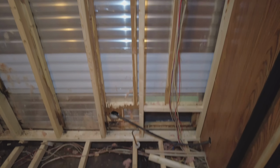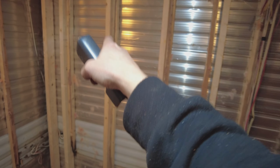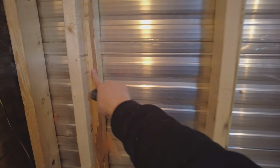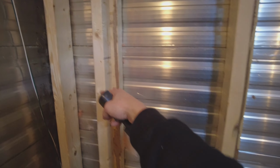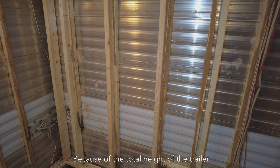I'll just flip this around so you're not looking at my head and you can look at what I've done. Yeah, so right in there, that's where the furnace goes. This area here, if I wanted to later on, I could remove this center stud, cut the siding along here, remove this, cut the siding flush to this one here, and that allows for a 30-inch opening. Now, a regular door will not fit in there, so it would have to be a custom door made by yours truly,